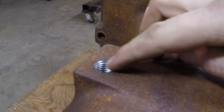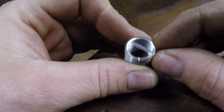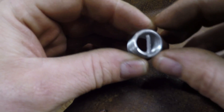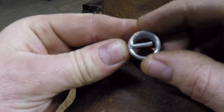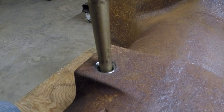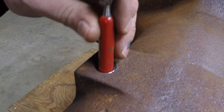Final step is to take the little tang off the end of the insert down in there. You can see it's pre-scored — that's so you can stick a punch down inside the insert and just knock that little piece right off. It usually just breaks right out of the way. Then reach down in with a magnet and retrieve it.